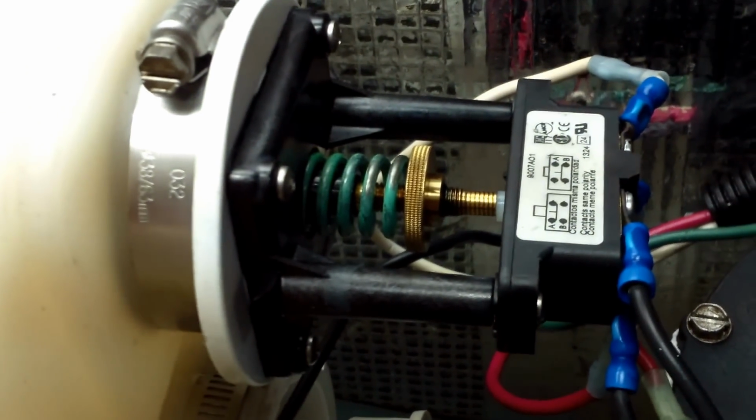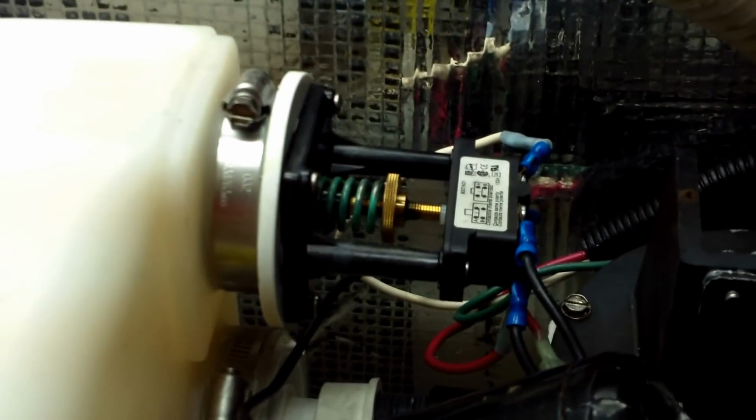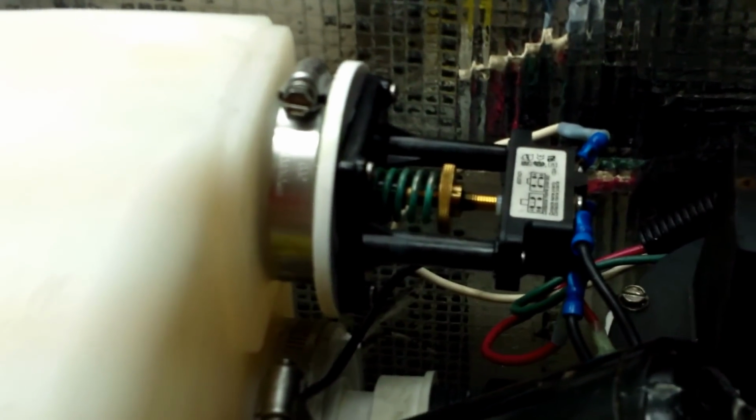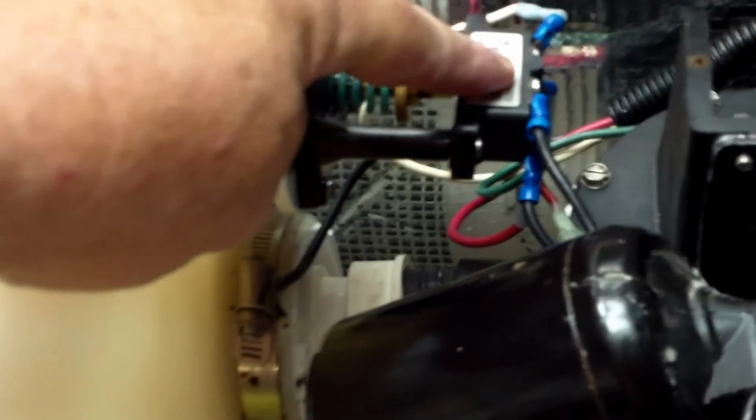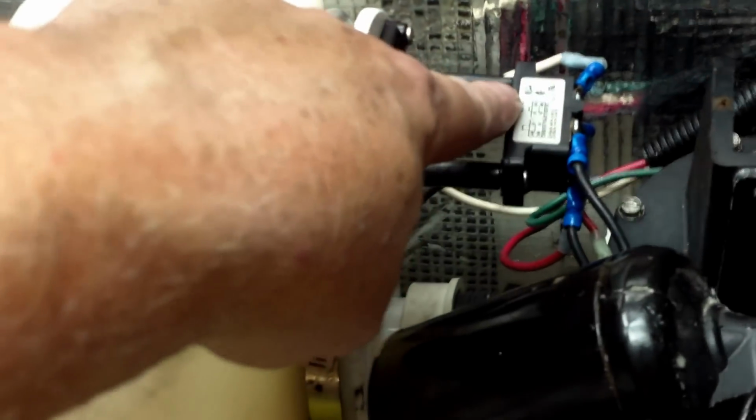The vacuum pressure switch is dedicated to 10 inches of vacuum from the front of the pump here to the half ball cock of the toilet itself, or the head. It's just a diaphragm pump. It gets sucked in, breaks the micro switch here, which then breaks the DC connection until you step on the pedal. Once you step on the pedal, it loses vacuum, engages the micro switch.